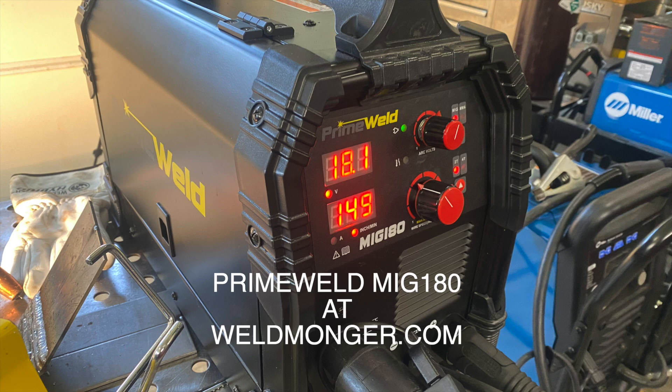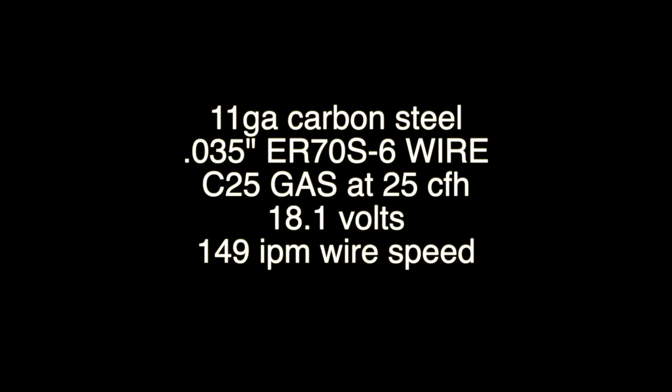This is the machine I use for this video, and here are the exact settings. The wire feed speed is a great deal lower than what is recommended, but on an eighth inch thick outside corner joint there's just not much area for the weld metal to go, so I got better results turning it down. All machines are different, but it worked with this one.